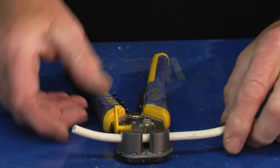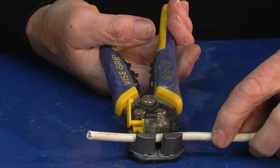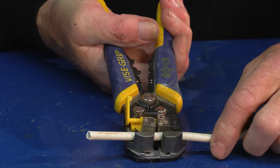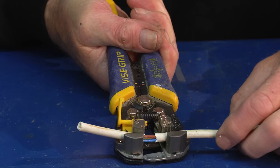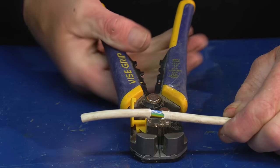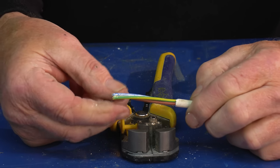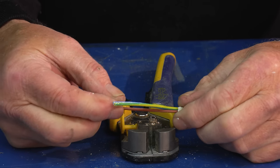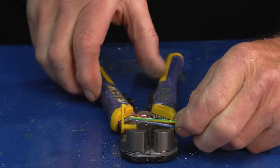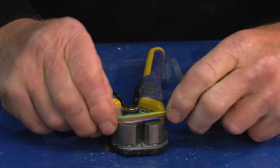Let's show you that with a bit of flex, because a lot of people find flex problematic. What you don't want to do is cut into that outer sheath and damage the cores inside. You can see what it does — it just pulls it apart, it's not cutting it. We can slide that off the end, and if you want to take a lot off, take it off in a few bite-sized chunks rather than trying to grab a whole section of outer sheath at one time.